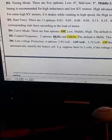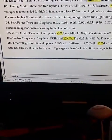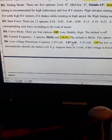I guess the reason I'm posting this is if other people can't get their racer to fly nice — I don't know what the default is set for this control frequency — but 22 kHz works much better.